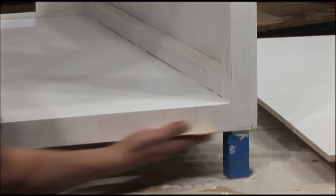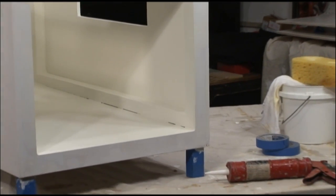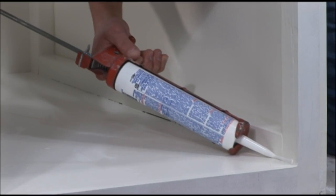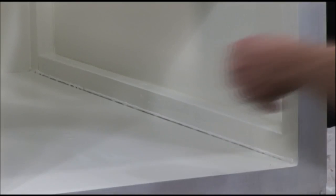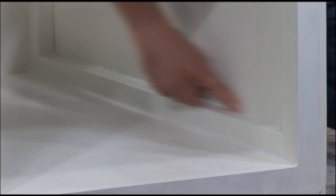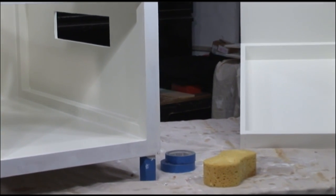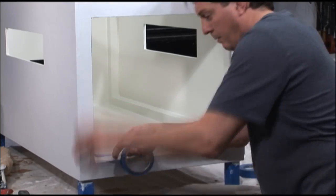All except the outside of the roof panels and the legs, we gave every surface — top, bottom, inside and out — a thick coat of primer. After the primer dries, smooth every surface with 220 grit sandpaper and give it a good cleaning. Now the cat house is dust-free, so we're ready to apply white latex caulk into the corners. Applying a healthy bead of caulk is very important — it'll help keep solids and liquids out of the corners. Have a sponge and a little bucket of water to smooth out the caulk with your finger. Now that the caulk is dried, give every inside surface — top and bottom of the house and drawer — three coats of white semi-gloss latex paint.